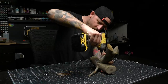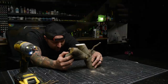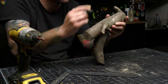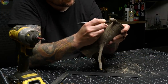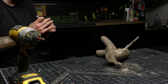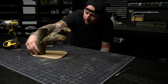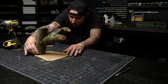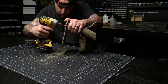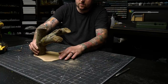This would make it plenty strong, which I already knew would be important on such a hefty build. To get a flat cut sitting level, I used the trick people use when making coffee tables out of driftwood — flipped it upside down so the top sat flat on the table, then marked a level line around the base to cut it at the right angle. I also cut and sanded a base out of quarter-inch MDF. The tree trunk was really heavy and would easily topple, so I attached it close to one end to leave plenty of surface area as a counterbalance. Again, a big deck screw was the way to go.